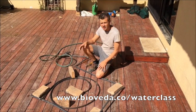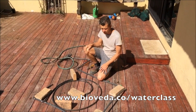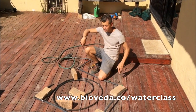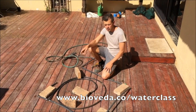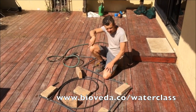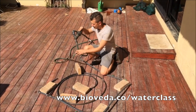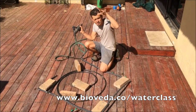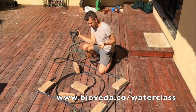But proof is in the pudding. Give it three months and then I'll show you what it is capable of. So it had a wetland at the bottom, that green drum, part of a 5,000 liter tank, and the trough had gravel, and that was cleaning the water from the bath. The bath water came directly, it cleaned itself, and then it irrigated itself, and that's why it has a filter that will stop the drippers and the sprinklers from clogging.